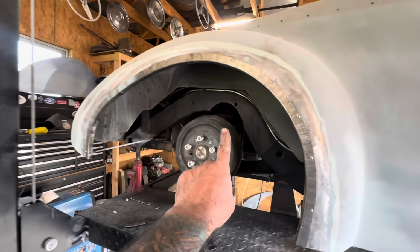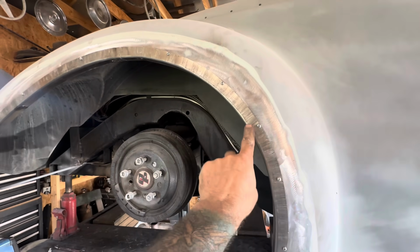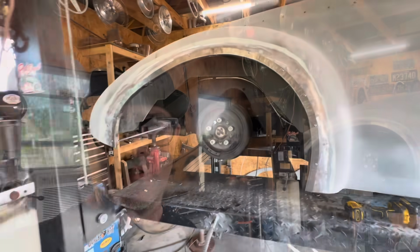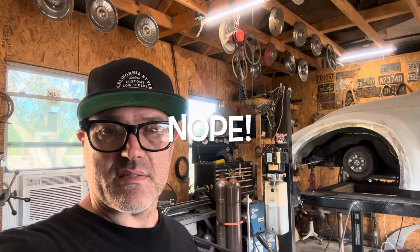So, I got the skirt taken off. This I'll put back on. Clamp everything, scribe it, trim it, bolt it all up, and we're finally ready to go. I was initially thinking I could weld it with the skirt still attached to the outer ring, but there's no way to clamp it. So, screwing it on there, scribing it, marking it, cutting it, and relining it should all work just fine. It's just not how I imagined it in my head.